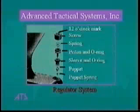The regulator system. For each month of regular use, disassemble the regulator system. Drop the poppet spring and pop it into place. Put a few drops of oil in the poppet cavity. Hand tighten the regulator sleeve into place. Clean and oil the regulator piston O-ring and put the regulator piston back into the cavity.